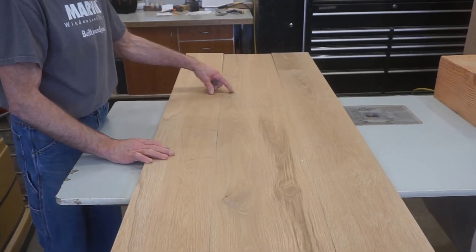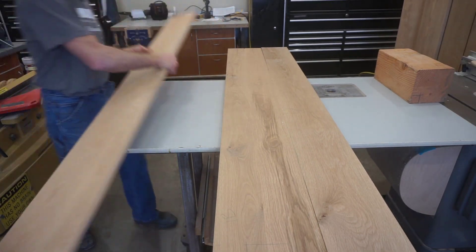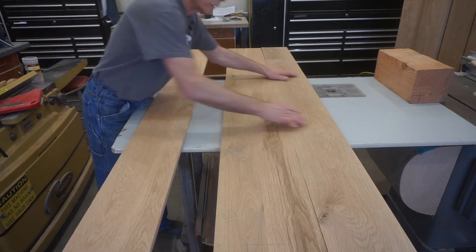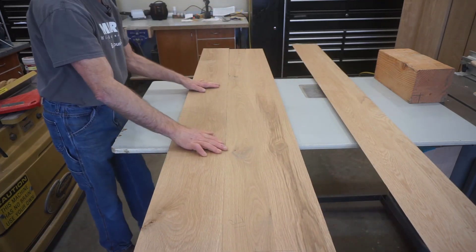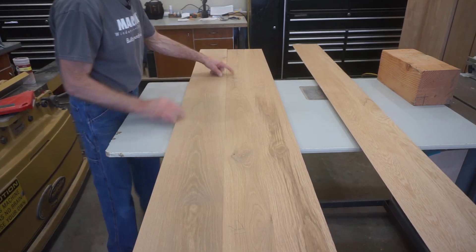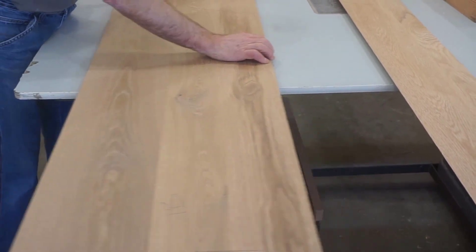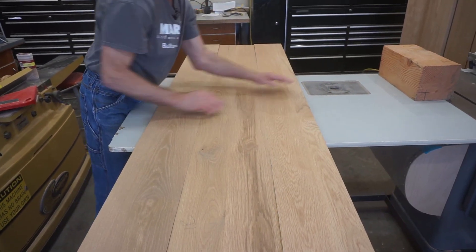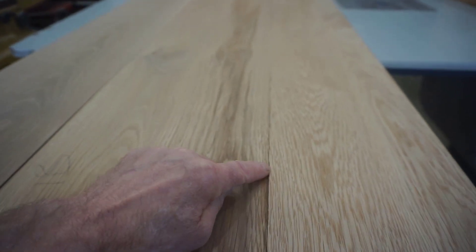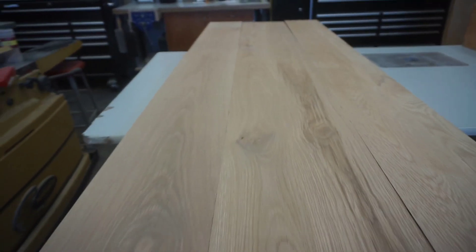Even though these get heavily textured and stained, I like to do the best job I can about matching up the actual grain features of the wood itself. This is not the final setup — I've got a big knot here, dark wood next to light wood that kind of shows up. I put the miter on this edge of this piece, but you can see that even the fit of this mitered side to this one is better than this grain to that. Here's the other side of the beam and that's a pretty decent match with the tones of the wood. My final choice was this: there are some knots on the edge, it's far from perfect, but it's a lot better than other options. The tone of the wood is about the same, and then the match from this side — tones and the grain of the wood — are a very respectable match. You can see the angle of the grain as it crosses this joint; it continues through the joint, and for this other joint I actually found grain that weaves back and forth across the seam for a rather convincing grain pattern on the corner.